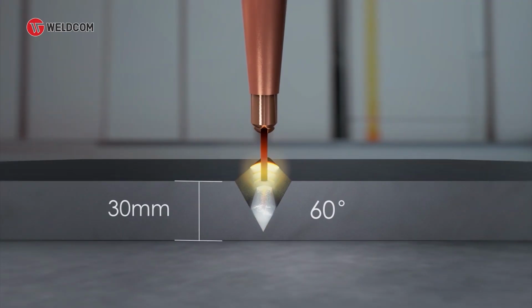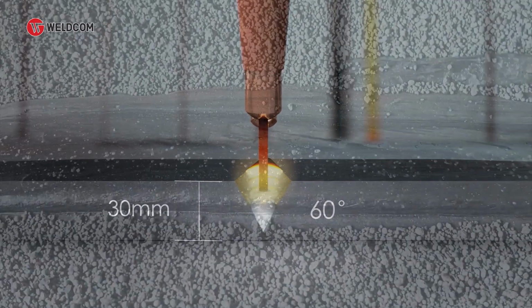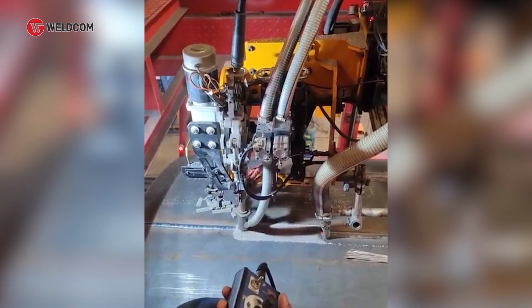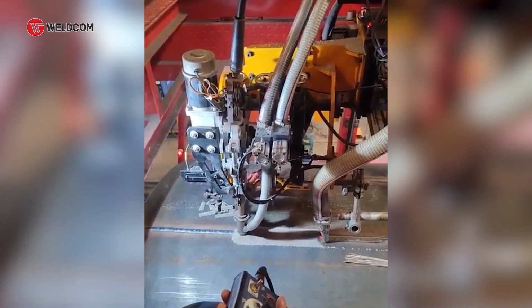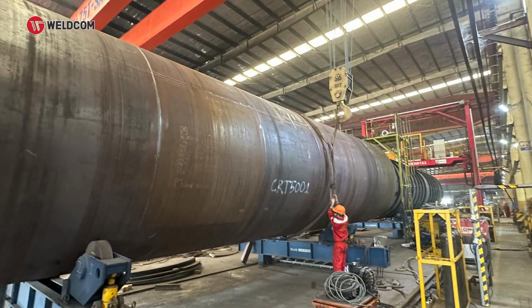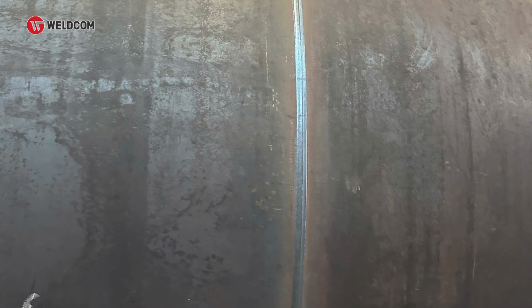Powered by OTAI welding sources. 1 ASA 1602 DC for deep penetration. 2 ASA 1250 AC/DC for wide and stable welds. This smart configuration maximizes arc performance, ensures consistent weld quality across full beam lengths, and minimizes post-weld deformation, critical for large beams and pipes.